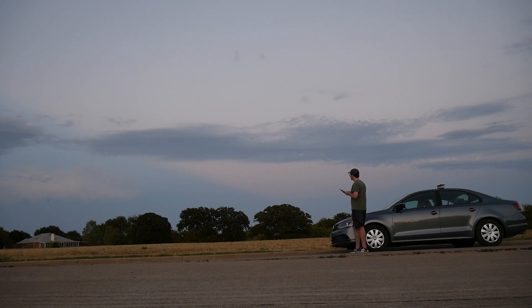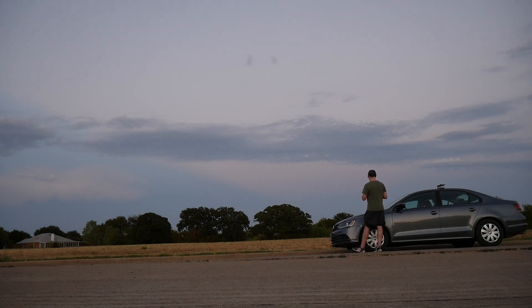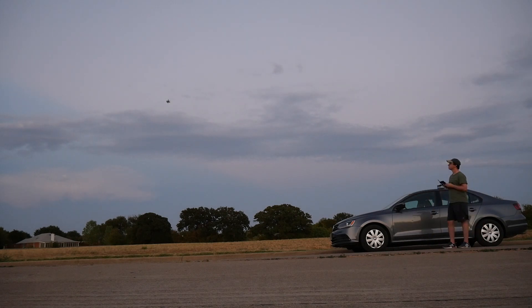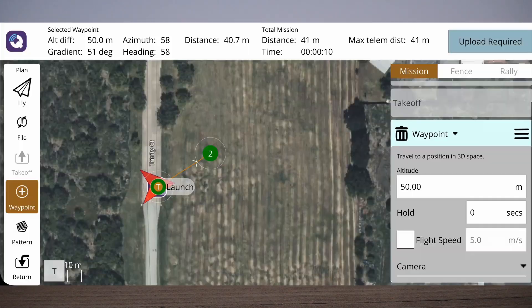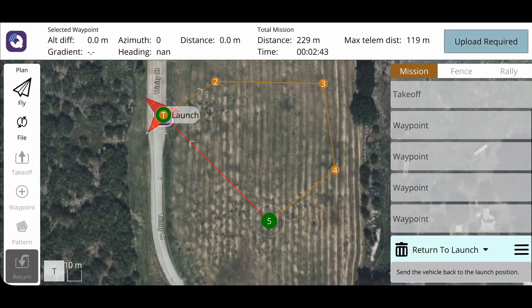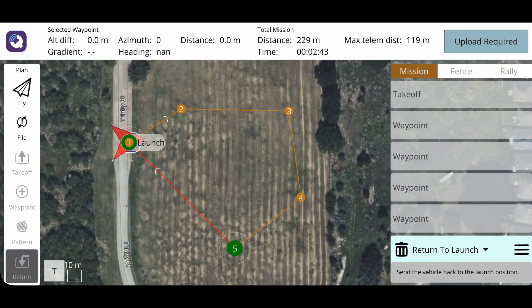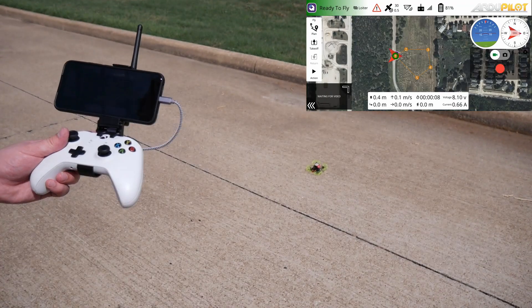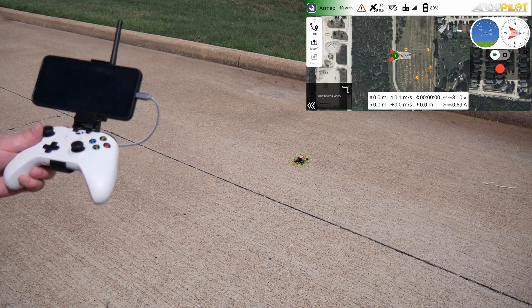Also, you're able to run the same scripts that we've made in the past to control the drone, whether that be the PyMavlink scripts or the Mavros scripts. You'll notice that there is only one radio in this aircraft. This is a little unusual for most drones because most drones use an RC receiver for a dedicated RC controller and also a telemetry link to get the Mavlink data down to the ground control station. I realized that I could save a lot of weight if I combined these two links together, so for this drone, I am sending my RC control over Mavlink, which allows me to eliminate the dedicated RC controller.